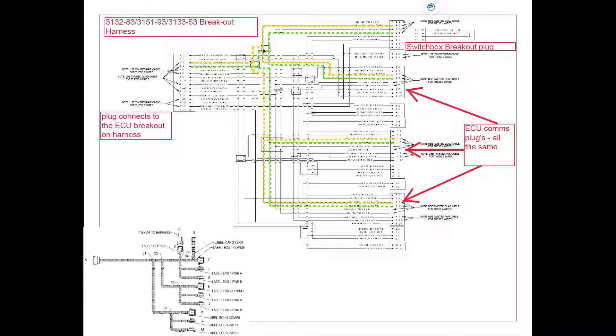The signal also breaks off from pin A3 to go to each of the communication plugs. The signal goes to pin 7 on each of the communication plugs. All three of these plugs are identical, so pin 7 is going to be the same on plug E, plug H, and plug K — all three plugs can be used in any location. CAN low signal on pin 4 — so pin A4 — splices off and goes up to our switch box breakout on the tank. CAN low is pin B4 at our switch box breakout. It also splices off and goes to each of the communication plugs on pin 8 — pin 8 on plug E, plug H, and plug K.